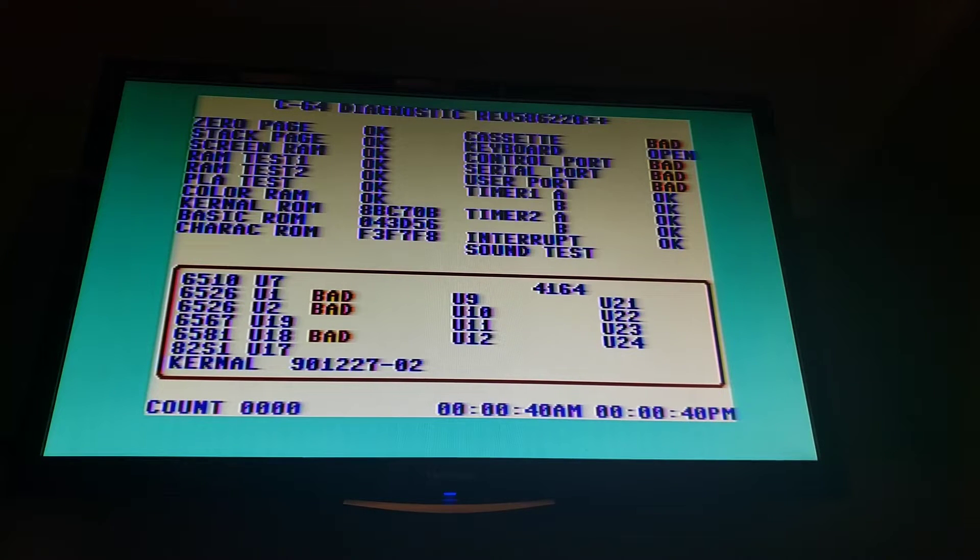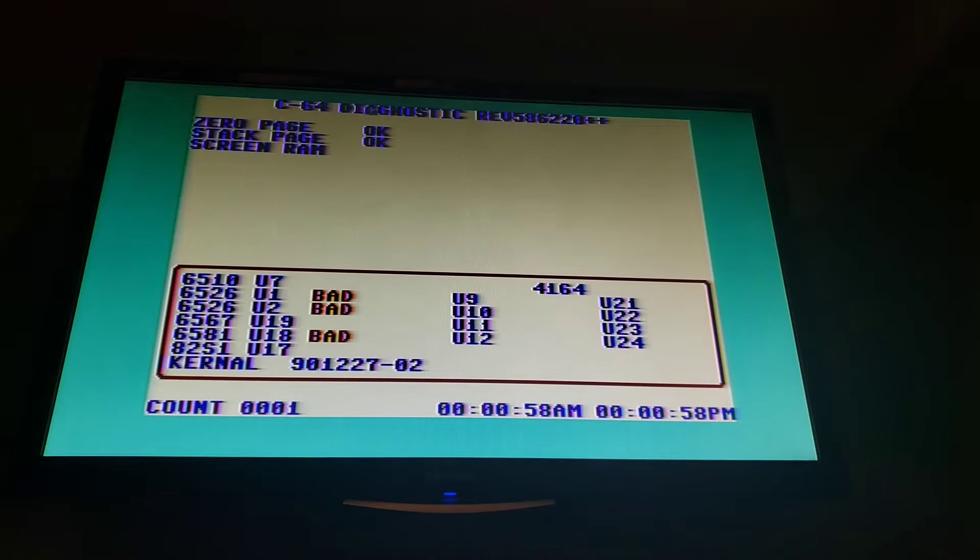Minus actually testing out the keyboard itself, let's just call this good. That was an easy fix. The main thing was a black screen — putting the dead test cartridge on, not seeing any flashes, meaning it's not even getting to the RAM. That starts by deduction through the three main chips. A SID can cause a black screen — we took that out. The VIC tested bad, but never trust the tester — put it aside, put another good working VIC in, still got a black screen. Tested the PLA, and there you go — the PLA is what it was.